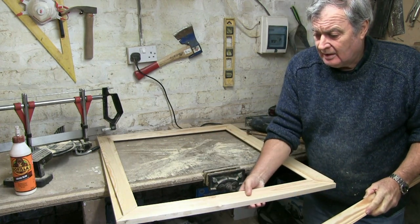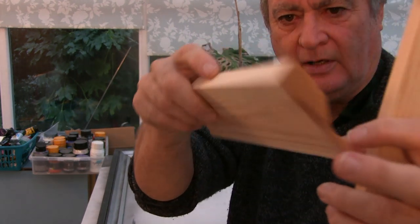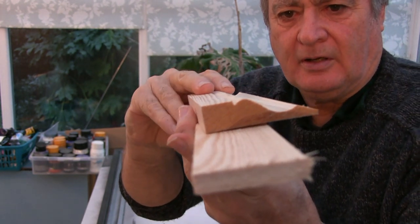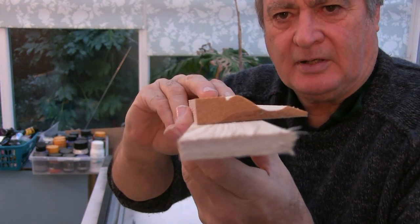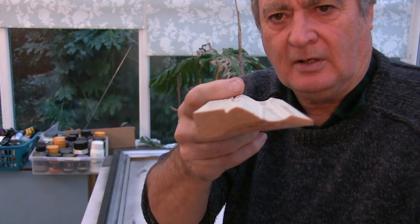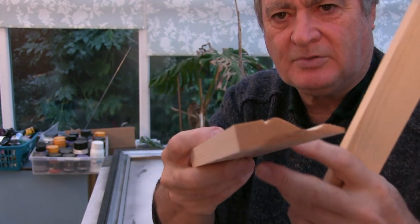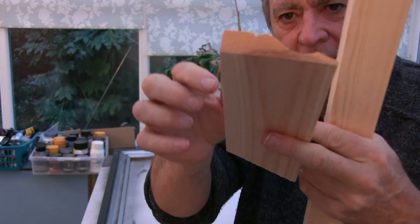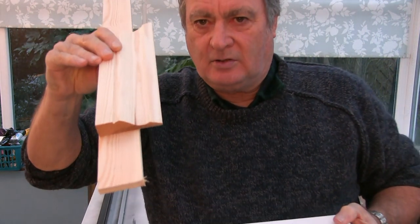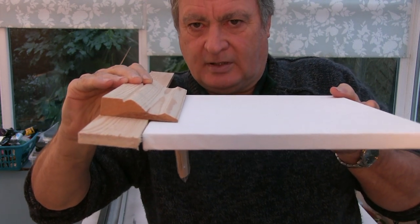What I've done is taken some ordinary picture rail. The wood I don't use for this — you can use architraving, which looks like this. You can see the cross-section here. That'll make a nice frame because we can put this piece underneath it, which will then leave the effect of a rebate here for the painting to slot underneath. I've got some ordinary rectangular wood, and you can use either picture rail, architraving, or even skirting board, as long as you've got this nice pattern on it. Usually we have the large piece at the back of the frame and the smaller piece at the front, making that sort of cross-section. When it's fitted together it'll just slot over the painting like this.